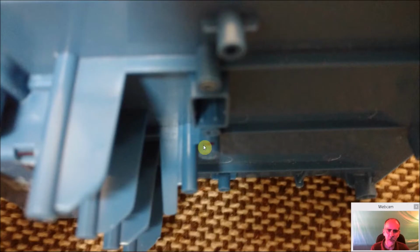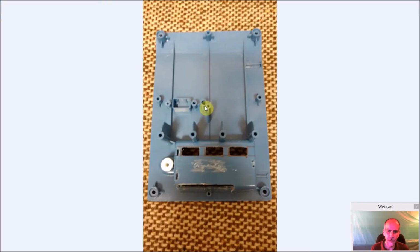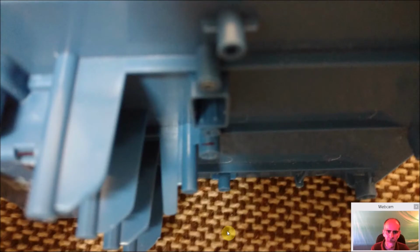So you can see on the center pylon, which is this guy right here, this was the reset hole for the Basic Fun. I had to cut it a little bit just to make the particular micro switch I got extend out far enough to be pressed. And I made it, and in the Space Invaders, it's pretty much flush. So you really got to get your finger in there so you don't accidentally hit it. The Space Invader, I'm sorry, the Pac-Man, I have extended a little bit more. It's a little bit easier to hit, but I found you don't really hit it that easily. So either one is fine. If you have to press in a little bit harder to make sure it shuts down versus hitting it by accident by being too far out, I'd rather have it a little further in.